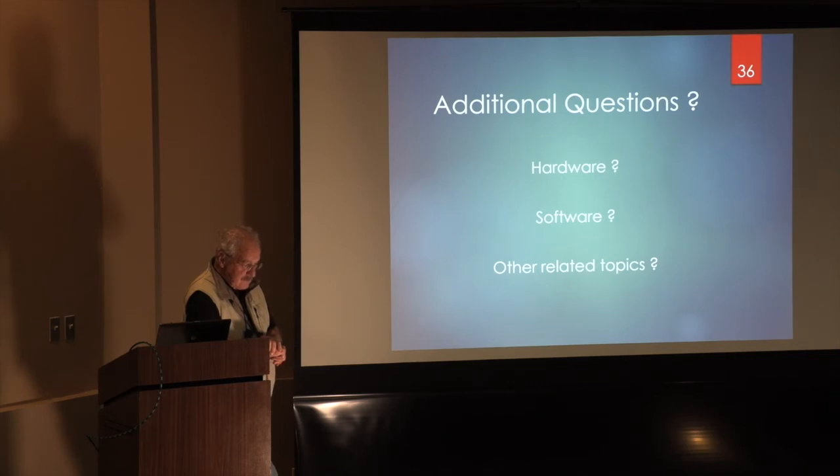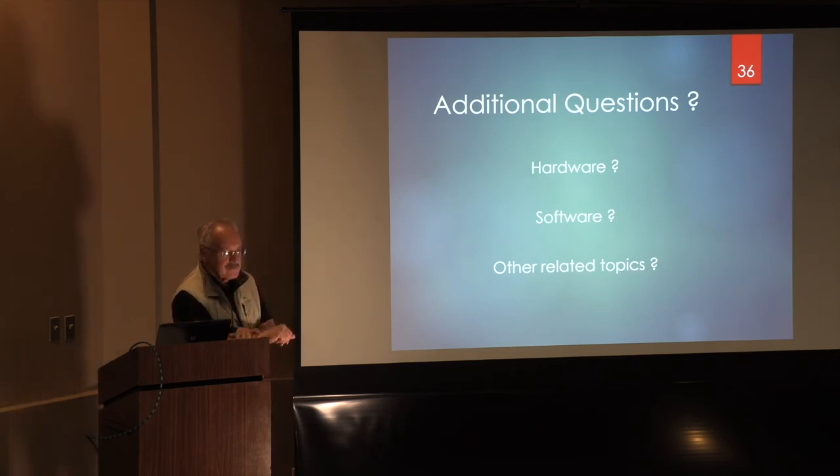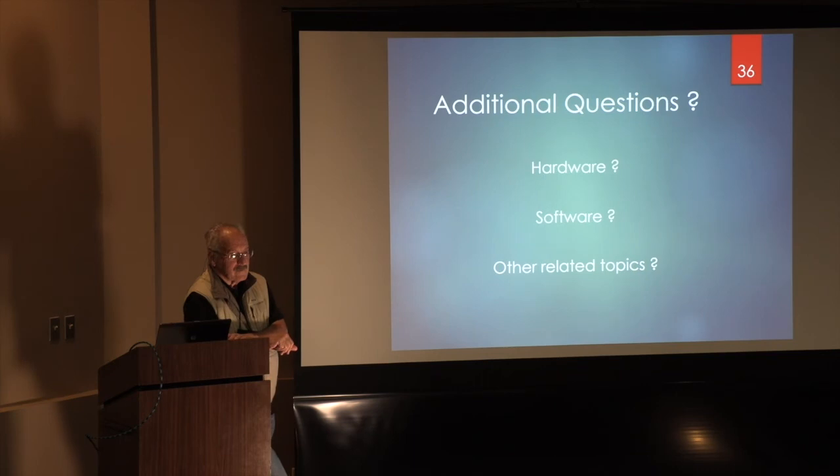It's interesting the choice you made — the concept of using it as a millimeter wave IF, a very flexible box to do that kind of thing. That starts to move your image frequencies pretty far out of band of your bandpass amplifier. Pretty soon your antenna is your bandpass filter — especially if you use high-side injection.